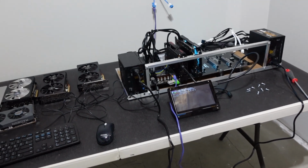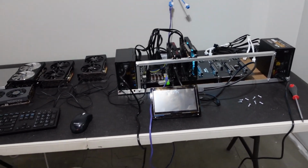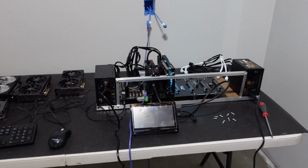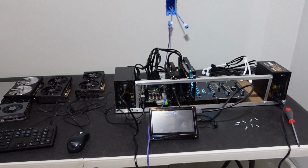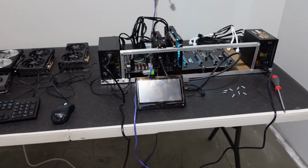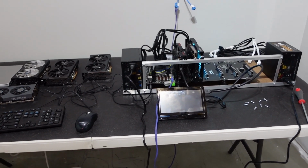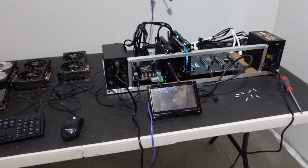Okay, miners, so we ran into a bunch of snags, but here we are. It's 12:30 in the morning and we're still working at it. So we got all of our cards wired up and good to go, and then we had to pull them out because when we powered up our rig, it was doing 5 beeps. And based off of what I was reading online, a bunch of people had recommended updating the BIOS and removing the BIOS CMOS battery.